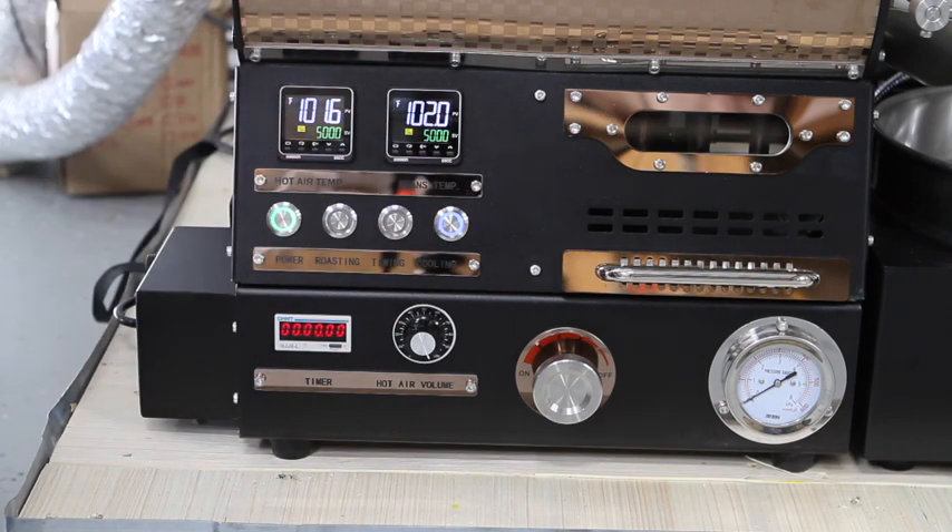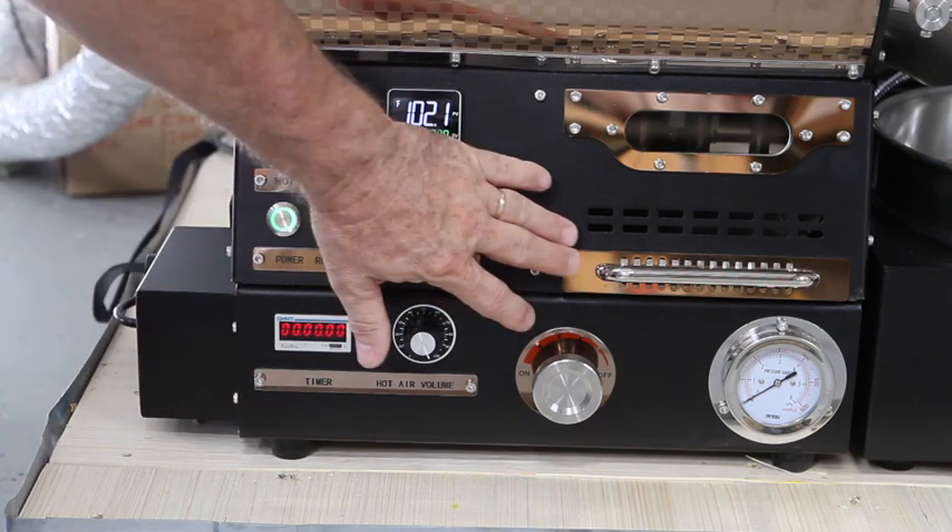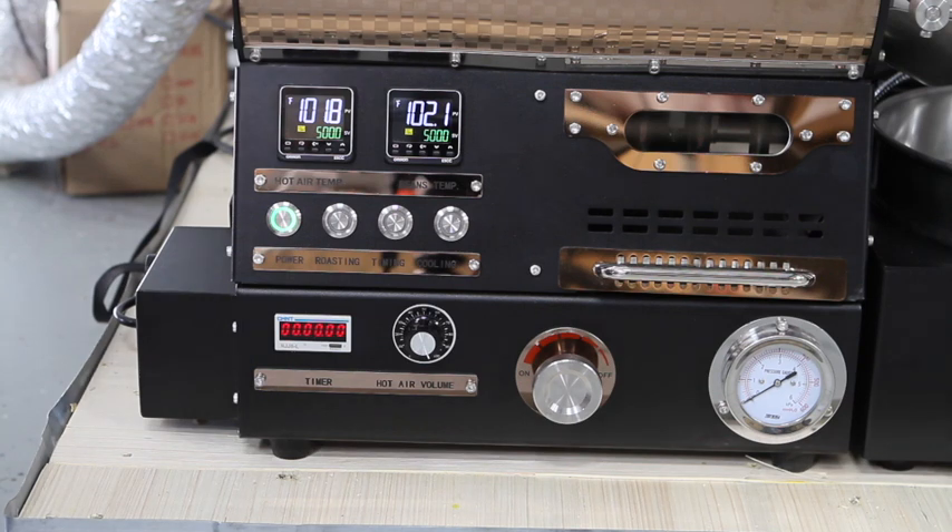It's a very powerful fan — in fact, it's the same power that's in our BC 3.5. Because the roaster is smaller, we don't have mixing arms on it, which really just get in the way with a roaster this size. We'll show you what we do during a full roast to get a nice, even cooling on the beans in two to three minutes.